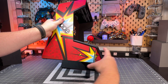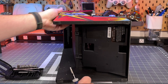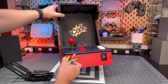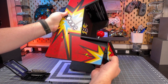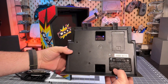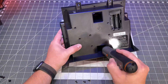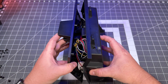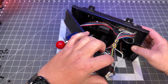First, remove the control panel from the actual cabinet housing — it's very easy. On the inside there are two screws to remove, and on the front there are two hex screws. Remove those four screws and the control panel will lift away from the arcade cabinet. Then we have to remove a lot of Phillips screws from the bottom of this control panel. Once those are removed, we can lift away the bottom and reveal the encoder board and all the buttons and wiring.